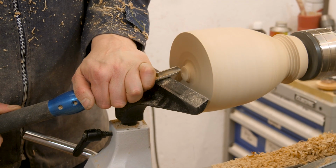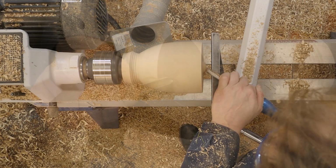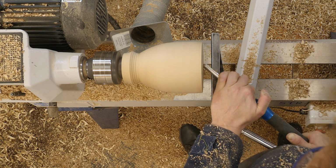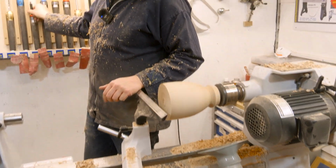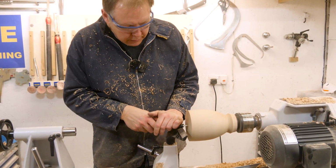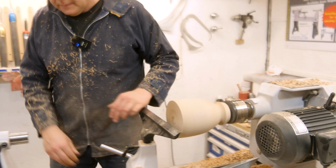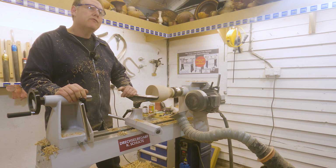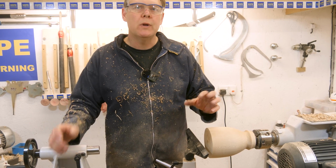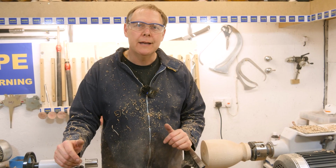We have a little bit of vibration, that's normal. So just adjust your cutting. Okay. Now, because I'm going to use a Forstner bit for drilling out, I'm just going to put the little cone dimple just on the center, and I'm going to get my Forstner bits ready just to take the core out, only about 15 maybe 20 millimeter, and then the tool would work a lot easier to hollow the inside out.